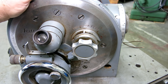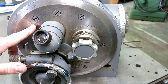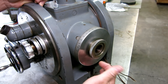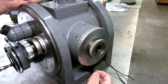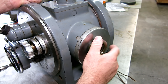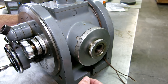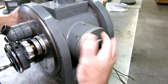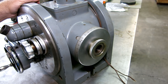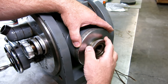The fine adjust here — if we engage that, we can do a fine adjust on this axis. You can subdivide to one arc second. The spindle main axis has a Morse taper in it — I'm not sure if that's a five or a six — and it has a little draw bar from the other side so you can suck something with a Morse taper in there and retain it. This was made as an inspection tool to inspect gears. Let me take this attachment off so you can see underneath — look at this beautiful knurled scale here.